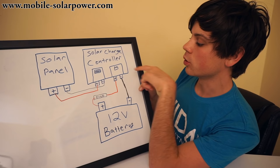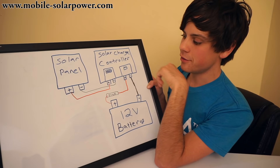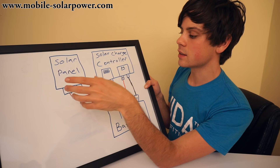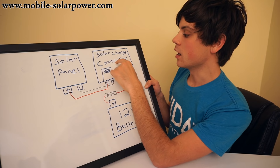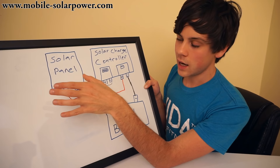It does get more technical, and my book goes over this with lots of pictures, where you have multiple solar panels. If you have six solar panels, you need to wire them in series and in parallel. What that means is that you put the wires in strategic configurations to make a voltage that agrees with the solar charge controller, because depending on what solar charge controller you use, that will determine what voltage you want your solar panels to be producing. For now, you don't need to worry about that.